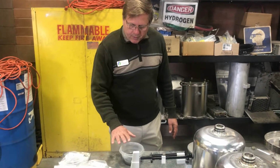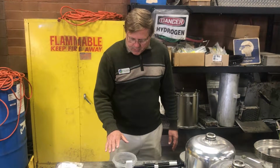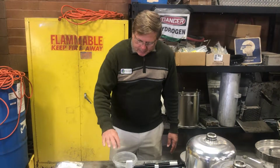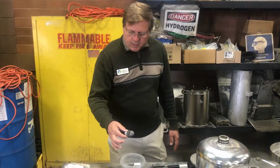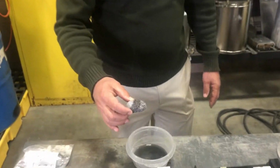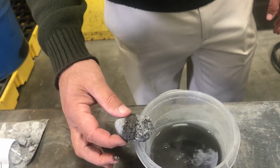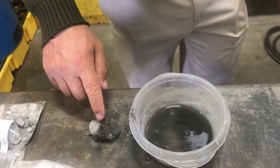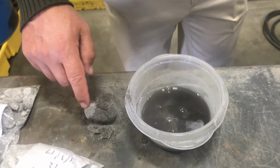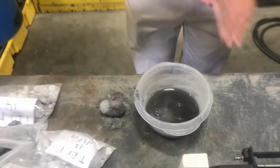So this is where we started with the original alloy. Now we have progressed to the point where we put it into several different systems and installed it on fleet vehicles. So I wanted to give you an idea of how that has progressed. You'll also notice that when the alloy reacts with water, it spalls. It takes up a lot of volume with the alumina or aluminum oxide, and that gets very hot to the touch. So we need to recover this alumina from the alloy so we can recycle it. So that was part of the thinking of how we put the system together.